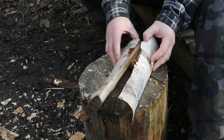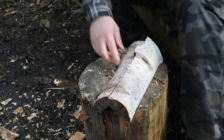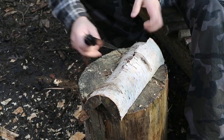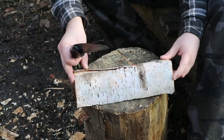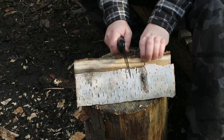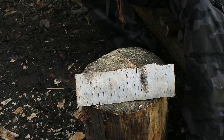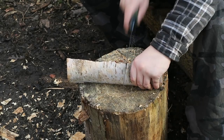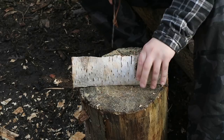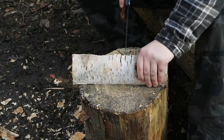I'm going to use these two pieces as there's no knot where I want to do the hole, which is going to be above this line here. I'm just going to mark that in some way on each piece — it's going to be there to about there — and on this one it doesn't matter if it doesn't line up perfect. Then I just need to saw in until I reach that shoulder mark so I know the hole is going to go through to the chimney area. Just going to put in a couple more cuts here just so it's easier to remove the waste.